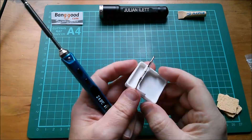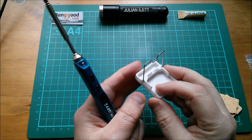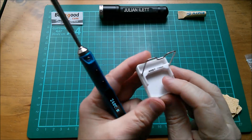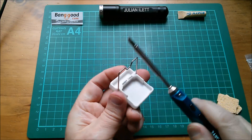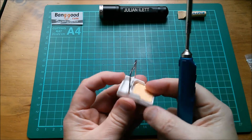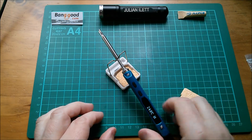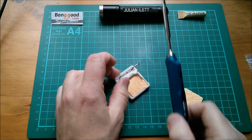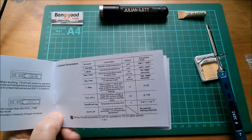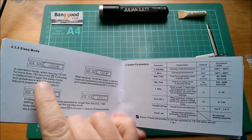I was going to get my other soldering iron stand but this one is actually really nice — this base is not plastic, it's ceramic, it's very heavy. There's a little metal thing here which I presume is where you lean the tip on, and you've got a couple of sponges here which are very tiny but fit in there. There's a nice cork insert and it doesn't slide off the desk because it has an indent. I'm now aware that this thing's sitting here at 240 degrees for no good reason — the manual says leaving it for more than 180 seconds will trigger sleep mode.